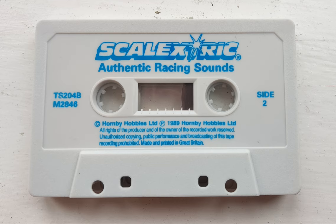Okay, I've done that. All right. Now take the red wires, which both come from the hand throttles, and slide them onto the other terminal, marked plus, and then tighten that up. Okay, now we've got the power connections ready. The next thing to do is what?